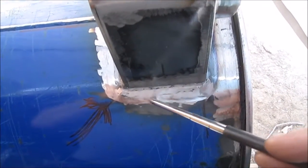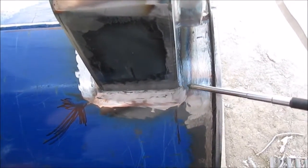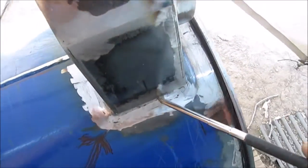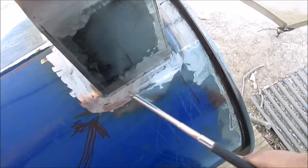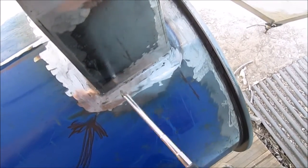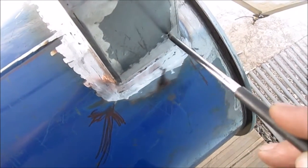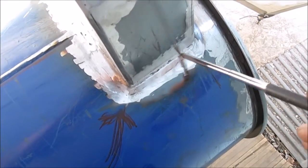So there you go. Not to make this one too long, but we tried to keep this squared. We went around with our grinder like this. Even though we're grinding away half the weld, we try to keep it squared, and we take our sanding flapper disc after we get down touching the metal right here. We don't want this any thinner. So we use the sanding disc right in here and up on this part. But the weld, we try to get it ground out.